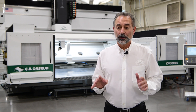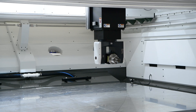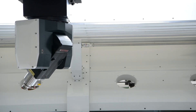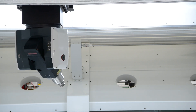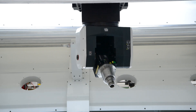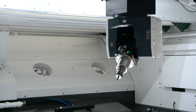To further speed up their production, we outfitted this machine with a continuous C-axis. Traditionally, a two-axis head must unwind itself after 360 degrees of rotation. But with continuous C, the spindle can rotate in any direction without restriction to perform even faster high speed milling in a single setup, no matter how complex the geometries.